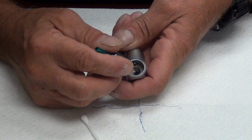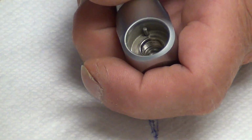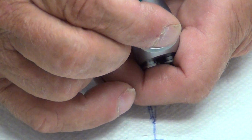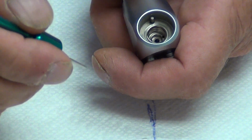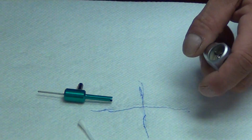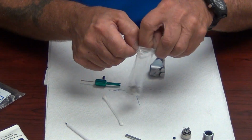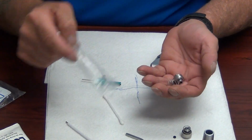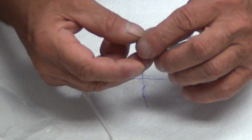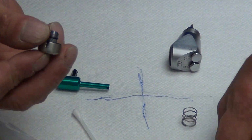As you look into the inside of the syringe, there's a small O-ring, as illustrated, that fits into an indentation. This O-ring is very important when reassembling the syringe, guys. We'll take our new tip holder. The O-rings aren't replaceable in the tip holder itself, by the way, guys. You have to replace the whole tip holder when you have this type of syringe.